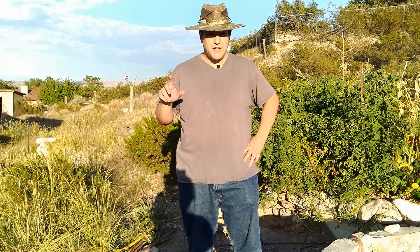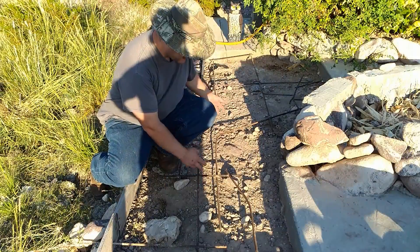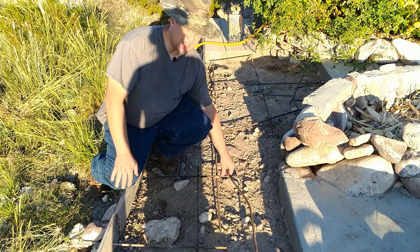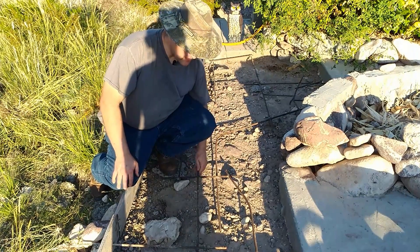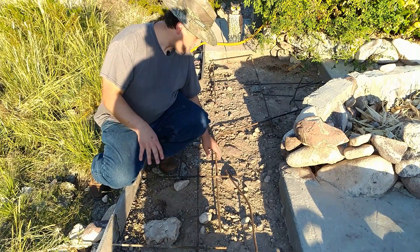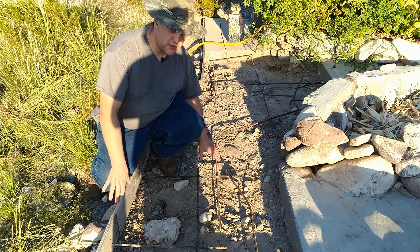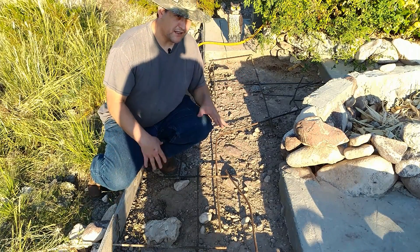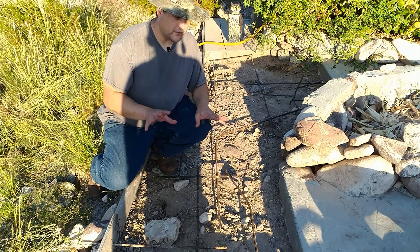In this case it involves laying a bunch of rebar. Let me change the camera angle so you can look at it. Right here I've got a bunch of rebar laid down, and this rebar is actually welded together. I ran two sets of 3/8 inch rebar — it's recycled rebar, which really helps save a little bit of money.